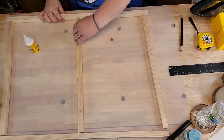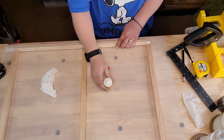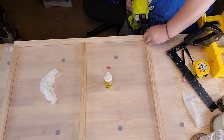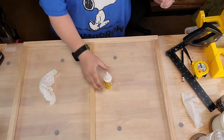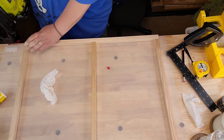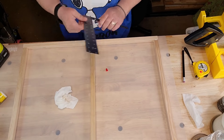I'm gonna take just wood glue for now. If you guys have heavy-duty staplers — not office staplers — most of them can fit little tiny brad nails and shoot brads. Mine does, but I'm taking my air pressure nail gun and just shooting some brads in the end of that, only because I'm being lazy and working fast. Then I'm gonna measure out the center.